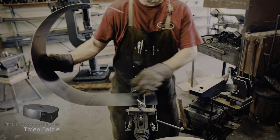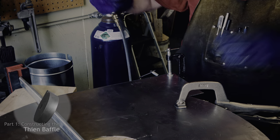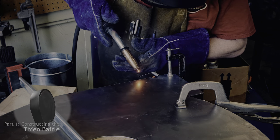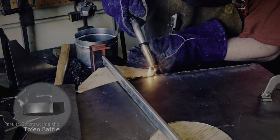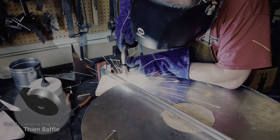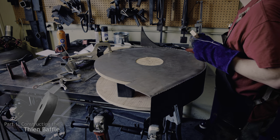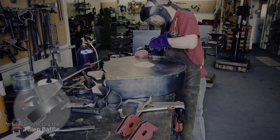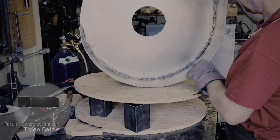Usually when welding, the clamping setup is the interesting part that makes for a successful weld. Here you see a circle cut from plywood that I am using as part of my clamping setup. The cut corners from the plywood circle are placed on the outside and allow me to press the sheet metal tightly together. I am using a stitching approach to prevent the metal from getting too hot and from blowing through the walls with a welder. The weld beads are somewhat ugly and need to be cleaned up later. I am slowly working my way around the circumference of the circle and reposition my plywood clamping jig as needed. Inspecting the inside shows good penetration on the welds.